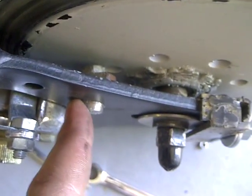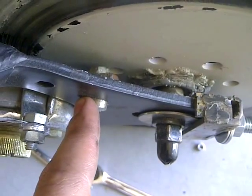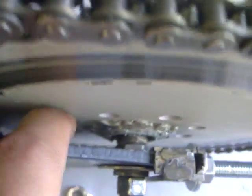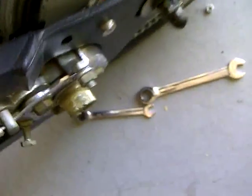I'm even going to replace that guy with something a little bit tougher. This is just a quarter inch screw that I had floating around. My only concern is I'm just hanging off one nut and that's all the room I have right there. You notice that another eighth of an inch and I'm contacting the gear. I just welded up a little bracket, just temporarily, to this other bracket coming off the side of this thing.